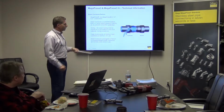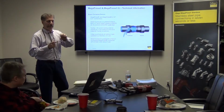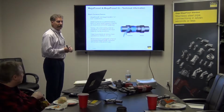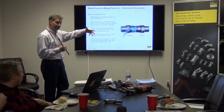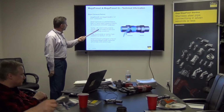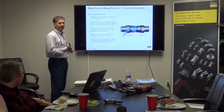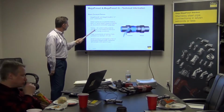And it's third-party tested, so that it basically proves that if you forgot to press one of those fittings, it will let you know before you leave the job site, whereas other materials may not do that, meaning competitors, and therefore you have 3,000 gallons of water on the floor 2 weeks later because it showed a false positive. It was not pressed, but it came through the pressure test. And testing all systems shall be carried out in accordance with the local authority having jurisdiction. Obviously, that's recommended. I know some guys don't pressure test, they just do the job and move on. So we always say to cover our recommendations, you gotta point that out.